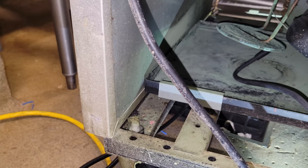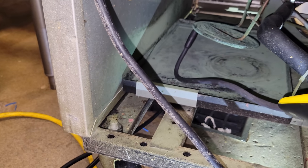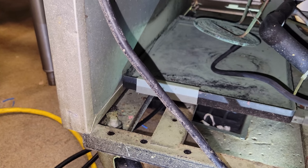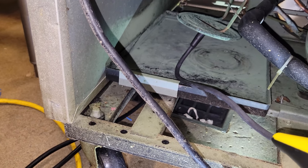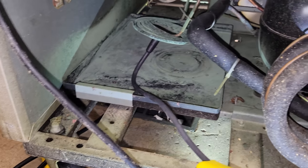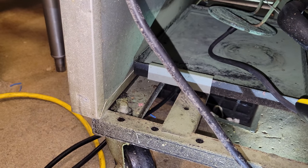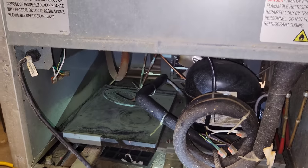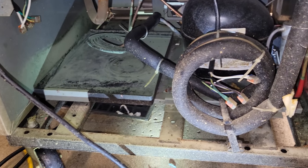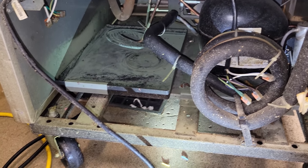It's very interesting. So when we were here the other day, we picked up the slightest trace, but it's not doing it anymore. And I have my leak detector set to the highest sensitivity, using the GasMate by Inficon. Nothing. That's interesting. This is one of those things where it doesn't have service ports, so it kind of sucks, having to add service ports, but this thing is not coming down to temp very fast. I'd expect it to drop significantly by now.